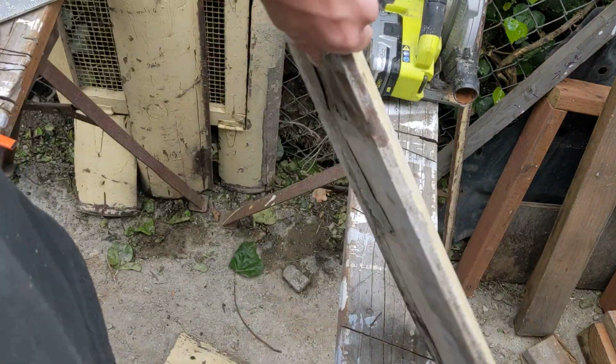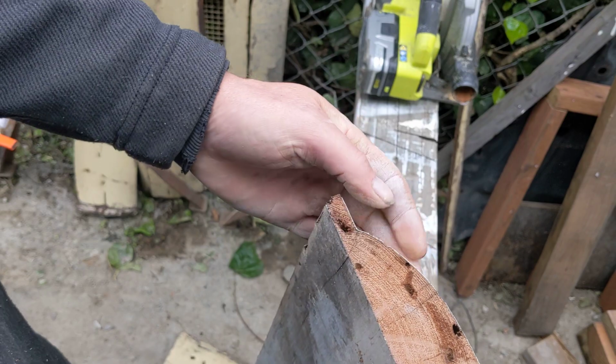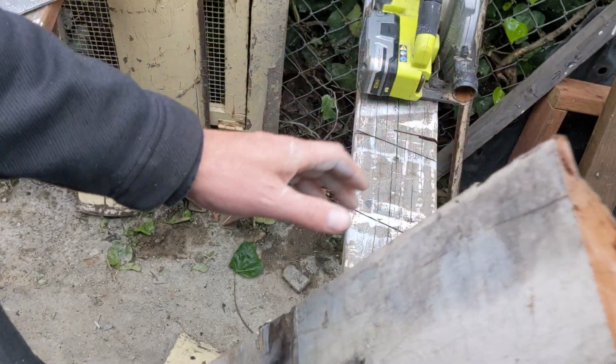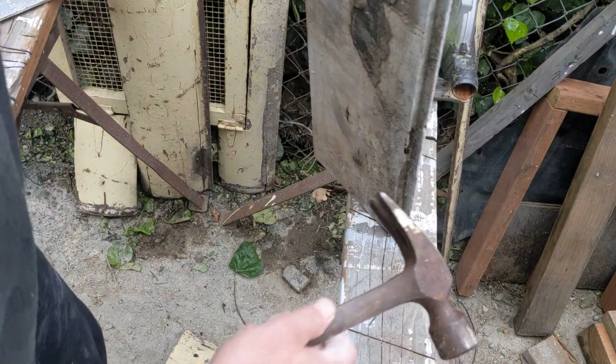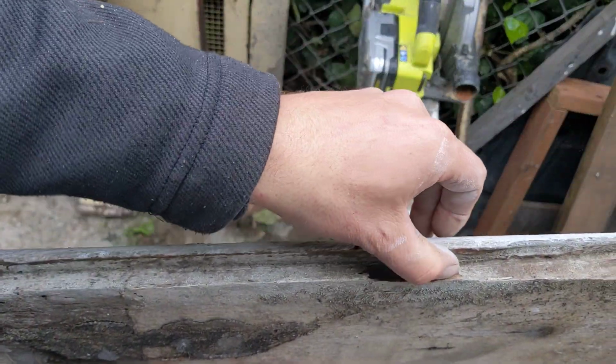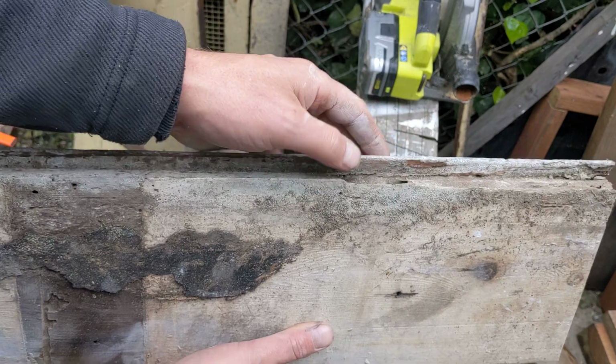Oh. Hear the sound of the saw going through it. Oh yeah. There's a few, you take that back another half an inch, but for what we're doing here, it's absolutely perfect. So you want to scrape out the grooves, make sure they're in good shape. A little bit of concrete in there. Oh. And then you'll see like, oh, what's that? All right. That's little spots like that. Very, like maybe 20 years ago, something was burrowing around in there.